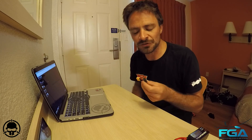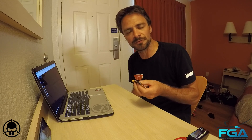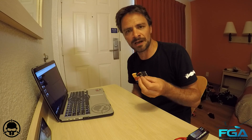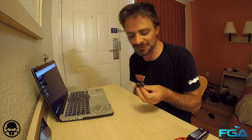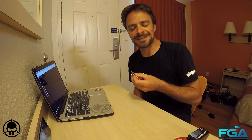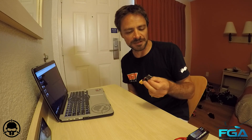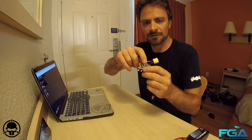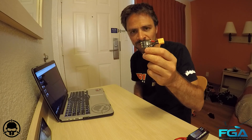These are the ones with the older versions — earlier than 1.02 — that don't have the bootloader software on them and can't be flashed through the user interface of the KISS FC. The ones I'm talking about are versions 1.01 and 1.0. They need to be upgraded to 1.02, then you can use the bootloader function in the KISS FC UI. The way you know which one you've got is most ESCs around today will have a little sticker on them saying what they are. So if you have 1.01, you need to upgrade it this way.